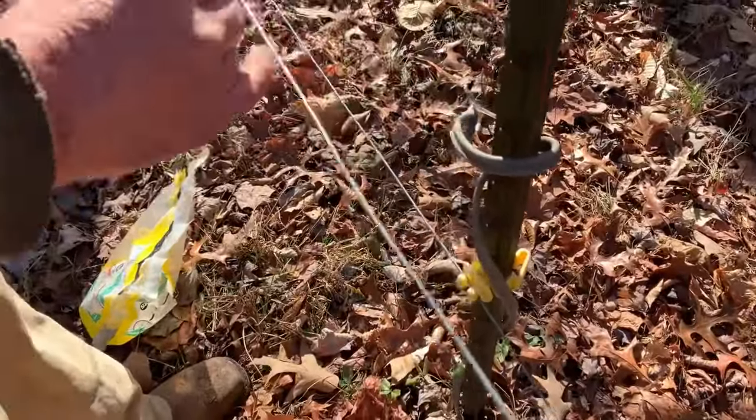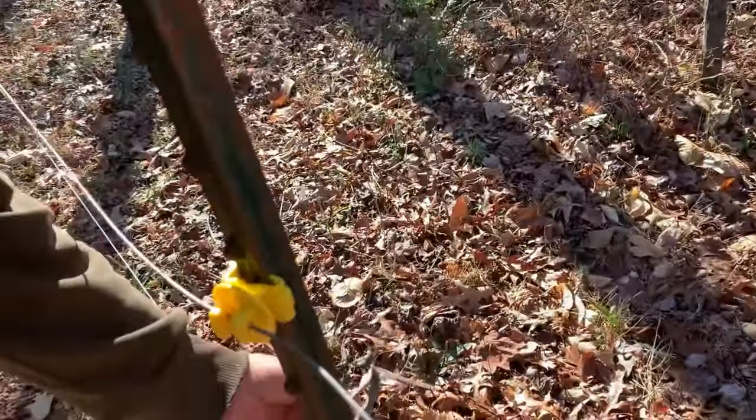So you can see this wire right here — that's what's been tied on to run power to our garden across the creek, because it's just right over there. Back in the early fall I discovered that this wire has a short in it and it's shorting out on the ground, because I was losing power on the fence pretty good. When I unhooked that wire to test it, the power came back on. So that's something on our to-do list before our gardening season starts again.